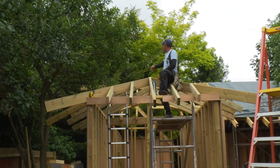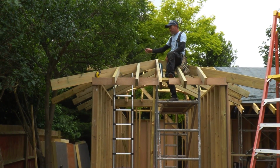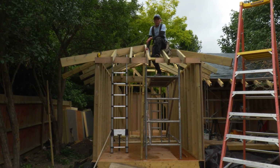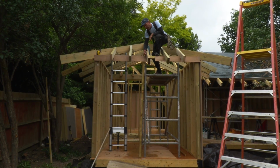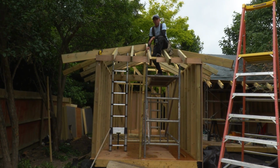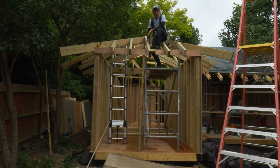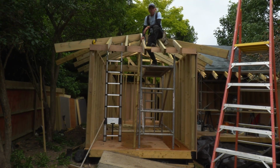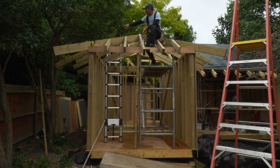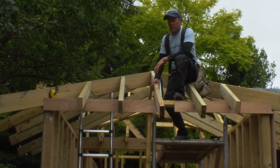So there we have the valley up there, labelled, the little valley rafters going on, ridges in, rafters are in, hips in, and all the little jack rafters are all in. I always pull a line through afterwards because I can measure out there accurately and cut it off, but the reality is it will be a little bit bumpy, so I'll never cut them until the end. Then I'll measure out either end depending on the width of the soffit, pull a line through, and then level the line round and cut it off in situ, because this wall might have a little bit of a bow in it here and there, and it's never dead flat, so I always cut them off afterwards.